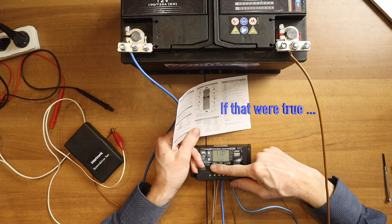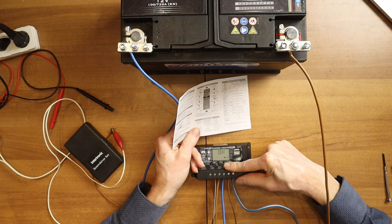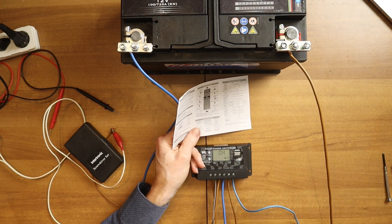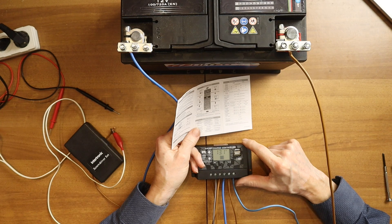If you put it on 0, and I will do that now — so now it is at 1, and that means one hour after sunset it will change. But now I go to 0, and that means it goes just from sunset to dawn, and at dawn it will close the lights again. And that's it.